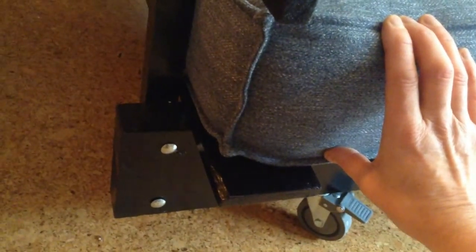Joists are cheap, mattresses are expensive, so get a thin firm mattress. This one is 150 millimeters — six inches — and the deeper the joist, the stronger it is, because the further apart the fixings are, the stronger the sticks will be at the side. A nice deep joist is good with a thin mattress to compensate. The top of the mattress should be 42 centimeters above finished floor level. If you're not sure, measure from the bottom of your foot to the inside part of your knee — that's the level you want. You want to be able to put your feet on the floor without the mattress pushing under your leg, as that's bad for your circulation.